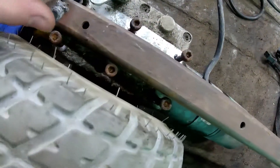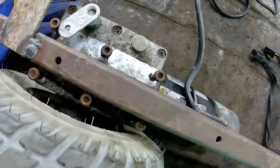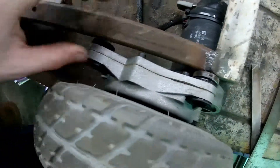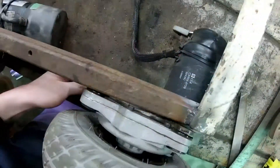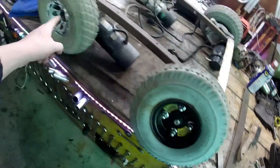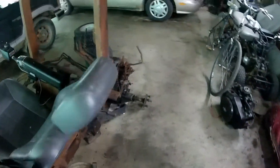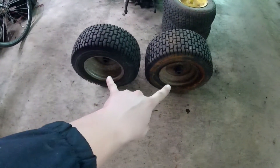I'm going to put a piece of flat steel and bolt those six allen-head bolts to the one-by-one box steel, same thing on the other side. In the back, I'll take two bolts and run them straight through the sides, and probably one down at the bottom as well, to keep it from flexing and breaking off. We designed this so the wheelbase from axle to axle is 18 inches apart, with just enough room — about an inch and a half — between the two tires on each side.